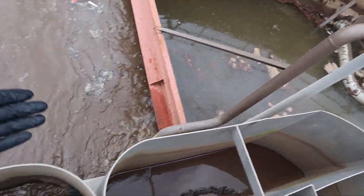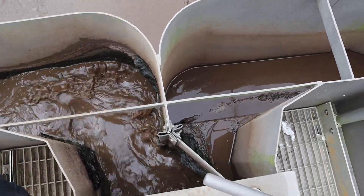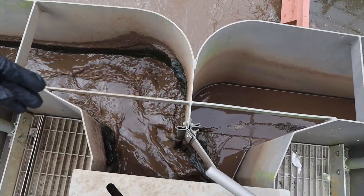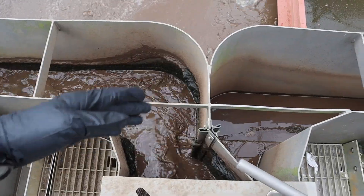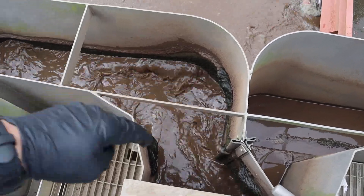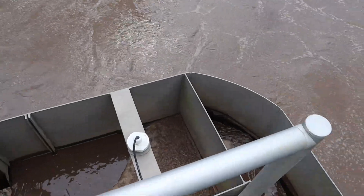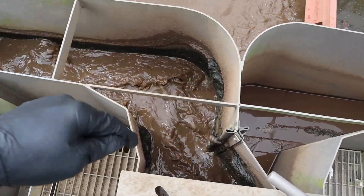That's the supernatant from your digester going back into the head of the plant for retreatment. The mop head we know about is right here — it's actually consumed by the mixed liquor right now in the return. There's the other end of it on the other side of the gate. What we're going to do is move this gate over to stop the return flow and waste just momentarily so I can get to the mop head, pull it out where you guys can see it, and keep it from going back through.